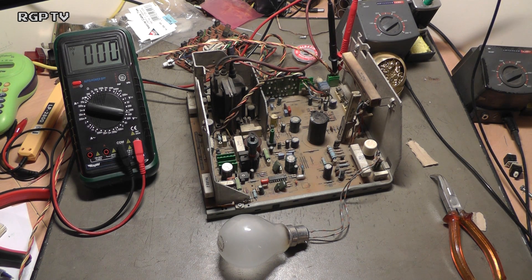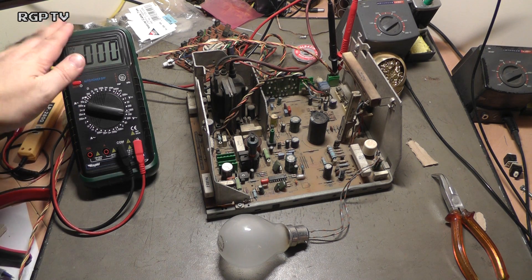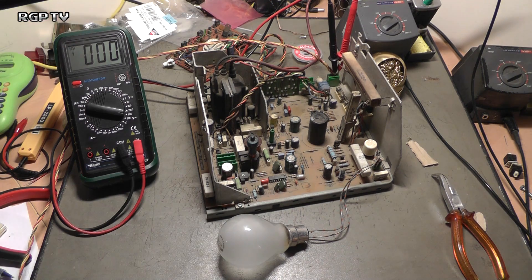That's about as simple a way as I can explain what the degaussing circuit does. It basically turns on 240 volts to the coil that goes around the back of the monitor and then reduces that voltage slowly. The effect is that it creates a magnetic field which pulls polarization towards the edge of the screen, affecting things like the shadow mask. I've looked on the schematic — that's how I know the 240 volts is just used in this particular circuit. I've followed it through and it's not used anywhere else on this particular chassis.